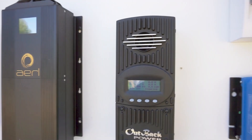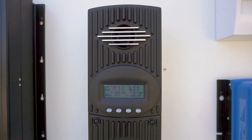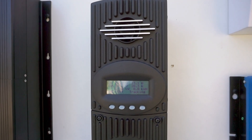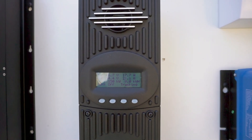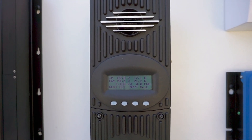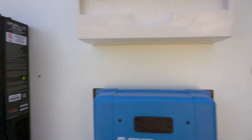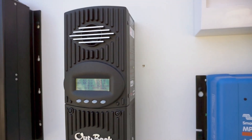Checking the Outback — it's tracking and showing 21.2 amps, doing some sweeping. It's showing 21.2 to 21.3 amps on the shunt and doing very well. It's reading 21.2 amps and 1.16 kilowatts — one of the older units performing strongly.